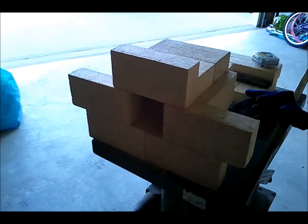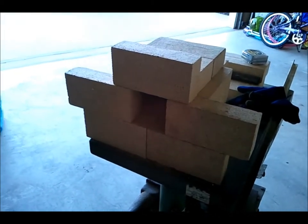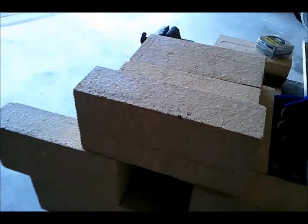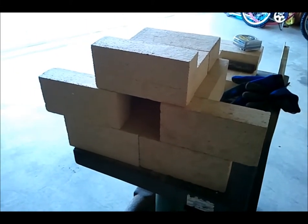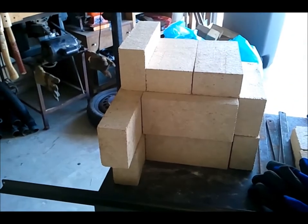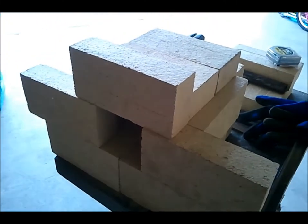I've been working on a little project here lately, trying to design a small forge to do some work in. I got some fire bricks that I just bought today — they're $1.27 a piece and they're rated for 2400 degrees Fahrenheit. I also got a sack of special mortar to be able to mortar them together, but certain portions I'm going to mortar and certain portions, no. It's going to be propane fired — so this is my burner.